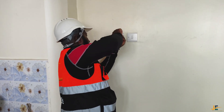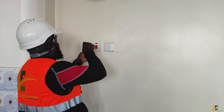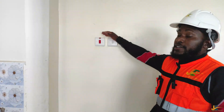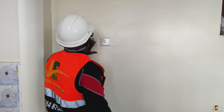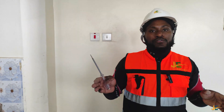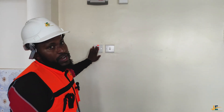So there we go — let's go. Make sure that the lighting switch and the DP switch are mounted or fitted on the same level. We are good to go. From there, you can test your switch by switching on the circuit breaker. Always make sure that before you make any termination, you take precautions by switching off the electricity. I switched off my instant shower circuit, and because I am through, I can switch it on. This is how my switch will be working.